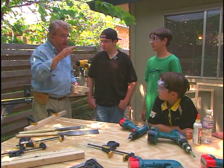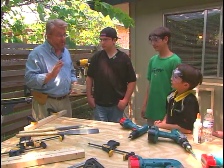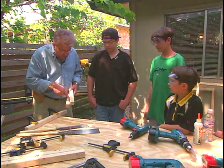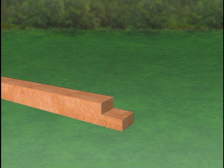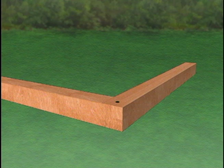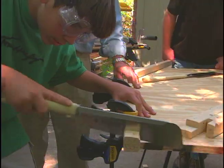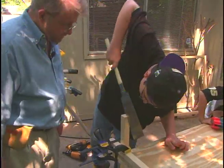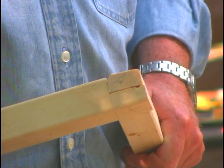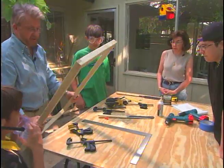We've put together all of our frame panels — top, bottom, front, back, and one end. The other end is going to be a door, and we're going to construct that a little differently because I want it stronger. We're going to use something called a lap joint. To create the lap joints, we're going to cut notches on the ends of each two-by-two, then overlap, glue, and screw them together. Ben uses my Japanese handsaw to cut halfway through the two-by-two, then Patrick rips along the grain until he meets Ben's cut. We check to make sure the pieces form a flush joint, then glue and screw them together. There's our door.